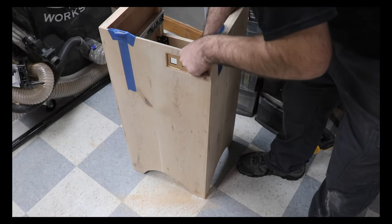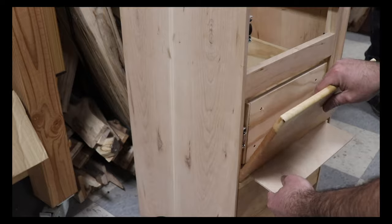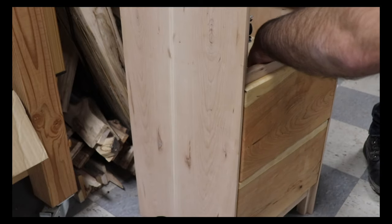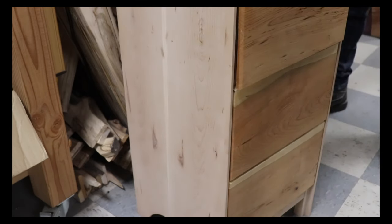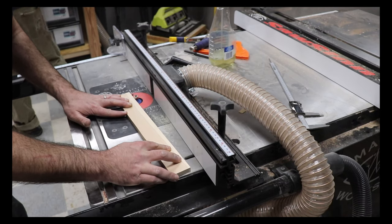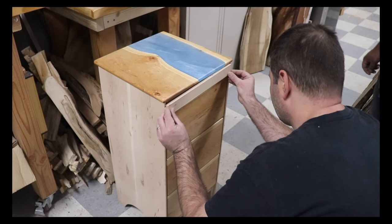The drawer faces needed to be installed very precisely. Any slight crookedness would be obvious because of the design of the front. We went slowly and used a scrap of 1/8 inch plywood as a spacer between each drawer face. Then we popped a screw into each pilot hole to secure each drawer face perfectly into place. Then we cut one last strip of cherry to top off the set of three drawer faces and routed it to match everything else. We intentionally left this to cut at the end so that it could serve as the very last puzzle piece and be cut to fit perfectly.